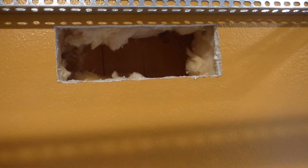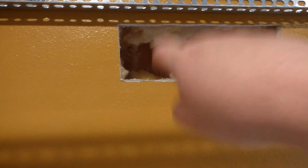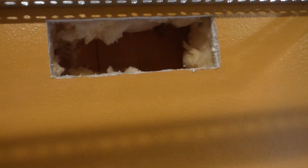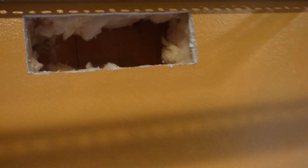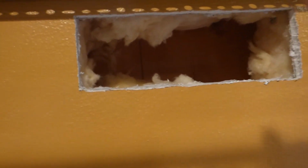But if you have a brick wall, then I'd be using a mason bit to start with to drill some starter holes all the way through probably, and then use a mason bit to cut out that chunk of brick. But since we don't have that, we have drywall. Use the drywall saw, and then use this drill bit to mark basically the 4 corners here on that back wall in there, and go through to the outside wall. And that's where I will continue.